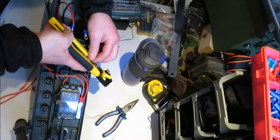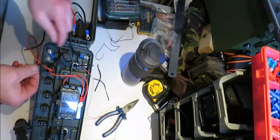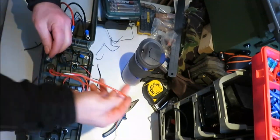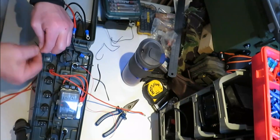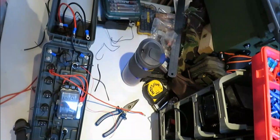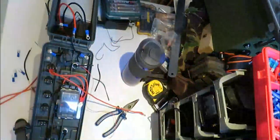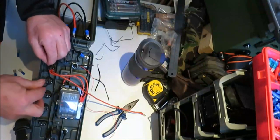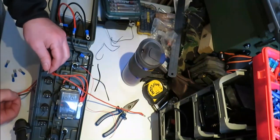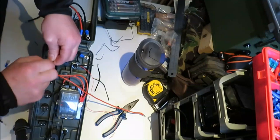Down the road. Right, now so we want to go from your jack, negative jack, move that out of the road, to the negative on this switch. Now it's all spades, all the ring terminals are finished with now, so it's all spades all the way down. So another spade. In fact, I put a couple down there. I'm going to go through there, through there, through there, through there. See if we can just twist the wires together.